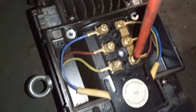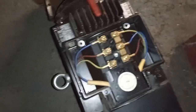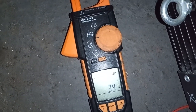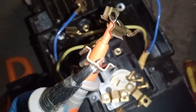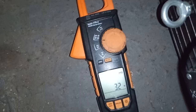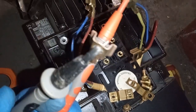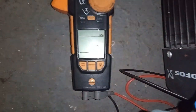I'm going to remove all the connections and then check the windings. Forgive me for not having my crocodile clips — I couldn't find them. So here we have it in ohms resistance. You just keep going along until you find two terminals that give you a resistance reading, then move to the next connections, and then the third reading.